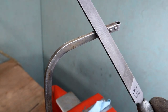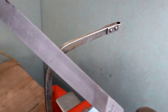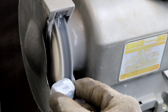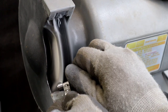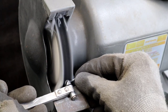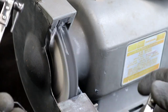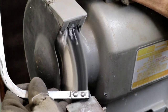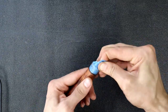It's easy to give the edges of a coping saw a clean look with some file work. You want a smooth, balanced stroke to prevent creating any low spots anywhere along the edge. Once you're happy with the look, it's on to the buffing wheel. This American-made buffing wheel is from Dyko — you can find them in the link in the description below. They come with a half-inch adapter flange, but you can drill those out and create your own size for a larger arbor washer. You'll also find Dyko's line of compounds in the description. I used an E5 here to remove the scratches from the sandpaper. If you want a mirrored look, move to the SCR or the GRN on a softer wheel. Apply the compound often and keep moving the piece to avoid heat buildup. This piece didn't come from EC Atkins & Co.'s factory with a polished look, so I fought back the urge to polish this thing off.